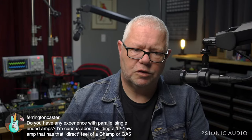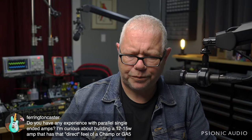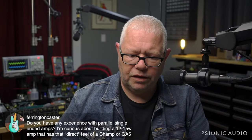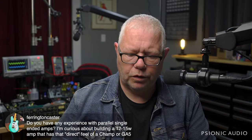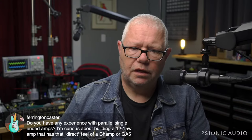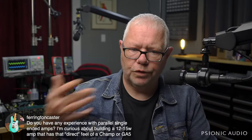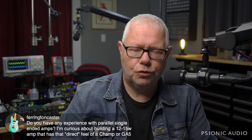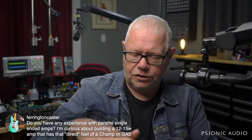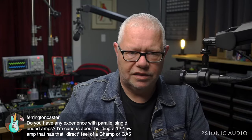Objectively, it seems like you're spending as much money as or more than it takes to get Class AB, and you've got so much more issue dealing with ripple and hum in general with single-ended. And the louder you make it, because you're paralleling tubes, the more audible that noise will be. There's a reason the entire industry said, all right, to a certain point, we're doing single-ended Class A. After that, everything's Class AB.